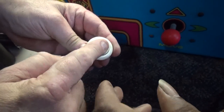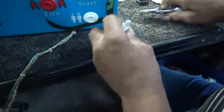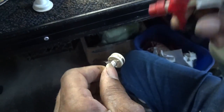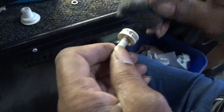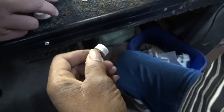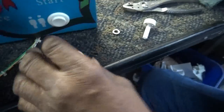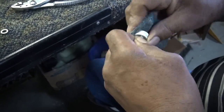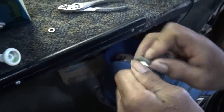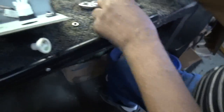What's probably happened is something gets in there and gets stuck down — it clouds the button up and it won't work. Pull it off and pull it out. You might want to send that to forensics — you probably don't want to know what's on it. I use steel wool to clean this because just wiping it with a rag won't do — it's really cruddy, years of crud buildup. While I'm cleaning that, I squirt cleaner on this and let it soak in, then go back and clean it off. You can see it's coming off — soon it'll be as white as a ghost.